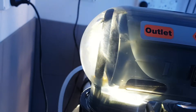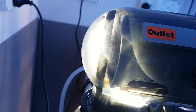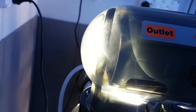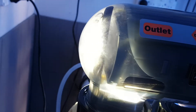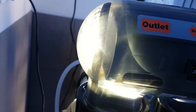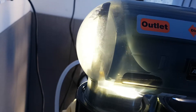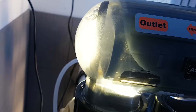What I'll do now is dial up setting four, which is 50 percent of its drive level, and we can see a substantial increase in the amount of gas being produced in the cell. That's about the halfway point for this particular cell. This is a 45 gram per hour cell, so it can produce about 45 grams of chlorine per hour.